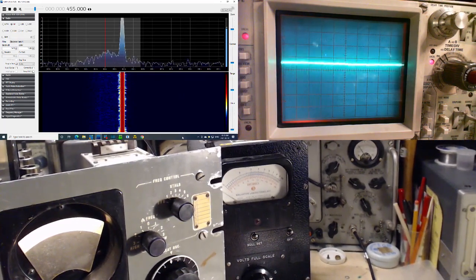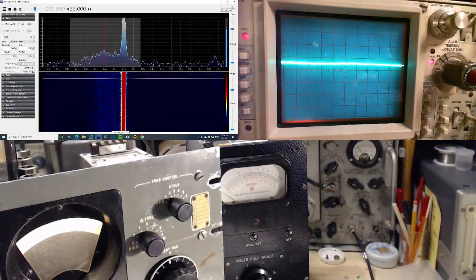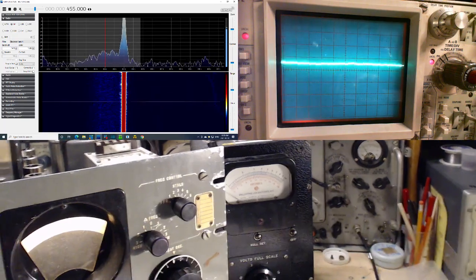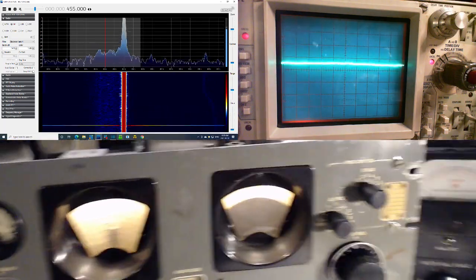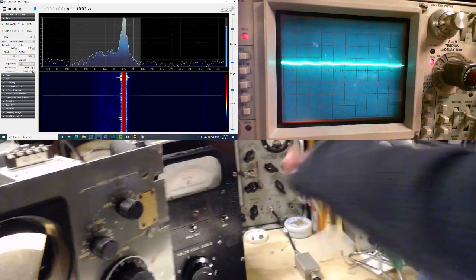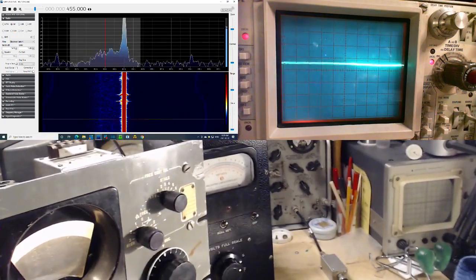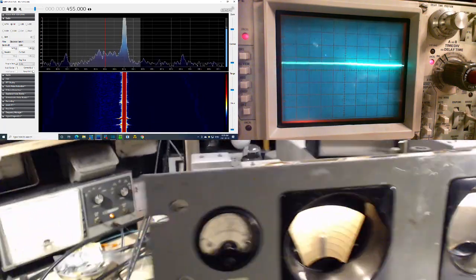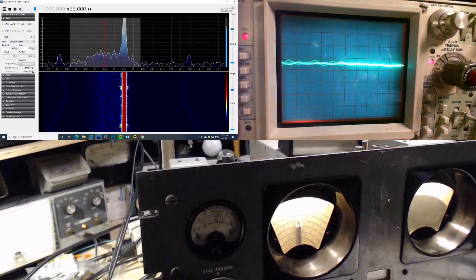Does it really? So I'm going to go away and calculate this. Okay, so that comes out to 1,000 microvolts. So we should get 60 here with 1,000 microvolts. What do we actually have going here? 100 times 2, 200. Yeah, so this meter is just out in every direction. Let's just see what happens if you get it up to 100. How many microvolts on the antenna? Only this one band here too, Jim.